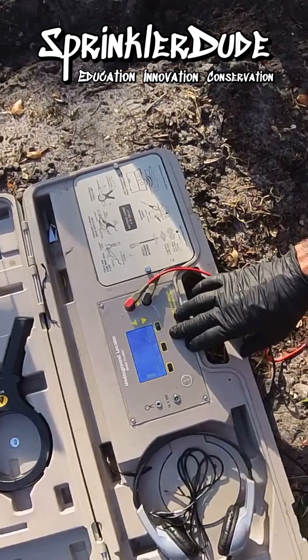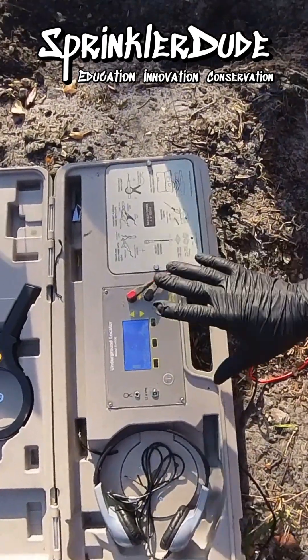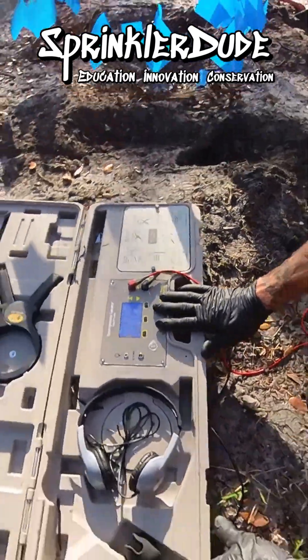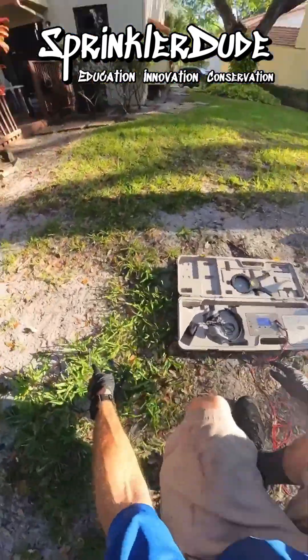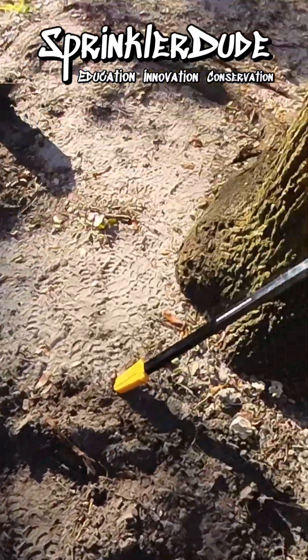We'll hit back and get to the regular screen here. We're going to do direct clip-on mode. This thing does do a broadcast mode, but we won't be using that today. The direct clip-on mode gets connected, in this case, to the ground right here, and then to the red wire right here that we're trying to track.